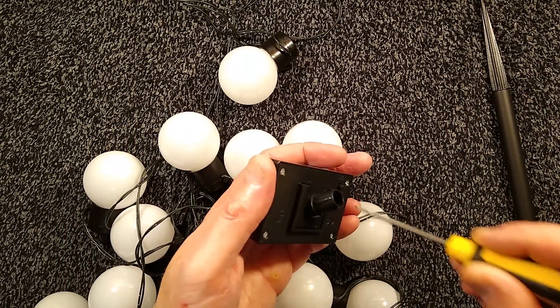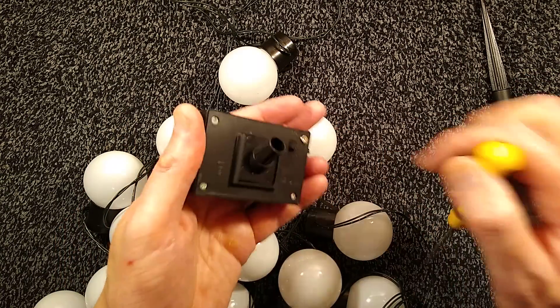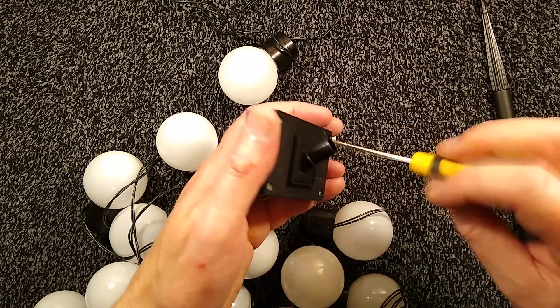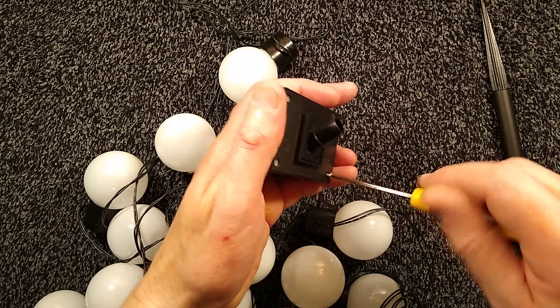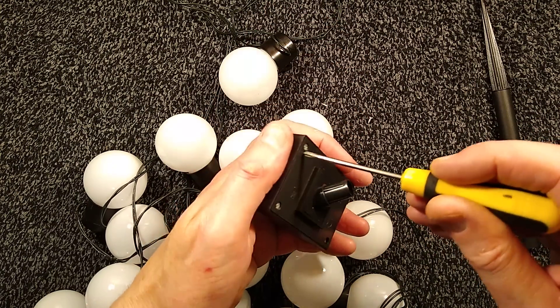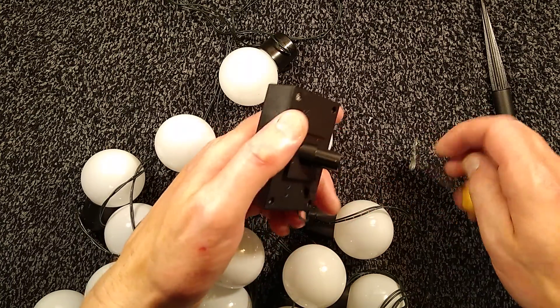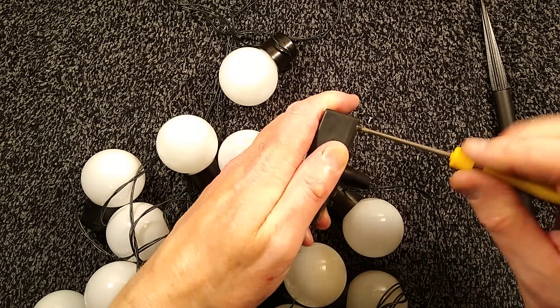Let's open it up. There are four screws. What's the bet — I hope it's not going to be a button cell. I should hope it's going to be a AA or AAA style nickel metal hydride cell. There's only four solar panel cells in the front, so that limits it to lower voltage cells — it's not going to be lithium.